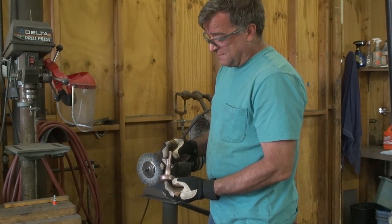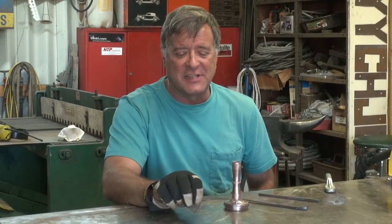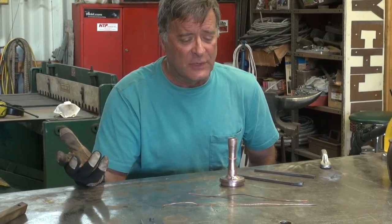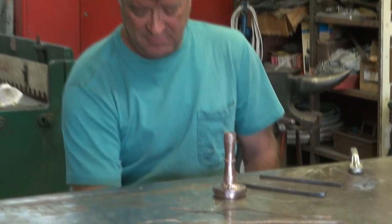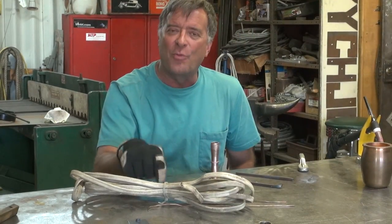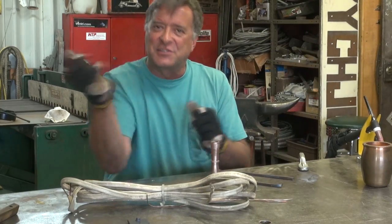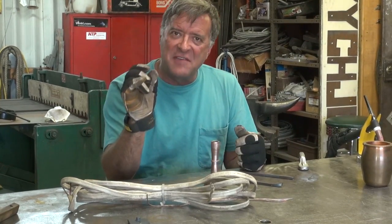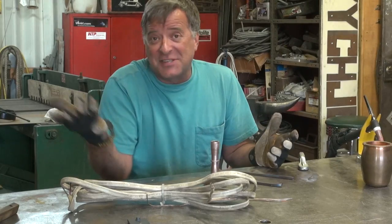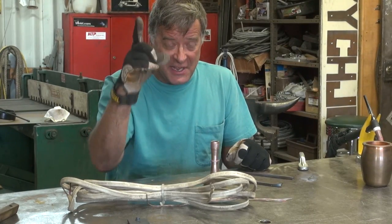You talked about the gas — what about wire? What are you using for TIG welding copper? Just a really heavy gauge copper wire. Where do you buy that? You can't buy it at the welding store — you buy it at the electrical store. This is just Romex, house wiring, building wiring. All I did was cut off a chunk and strip all the insulation off of it, and you've got a nice heavy gauge pure copper wire you can sit there and weld copper with. I had some left over from a remodel on the building. Reuse, recycle — good thing.